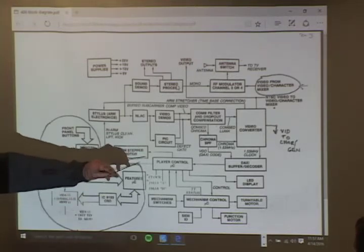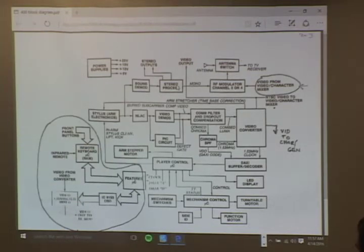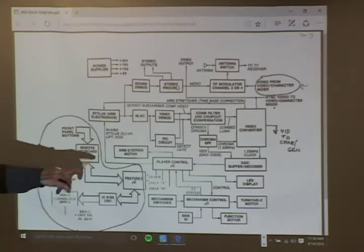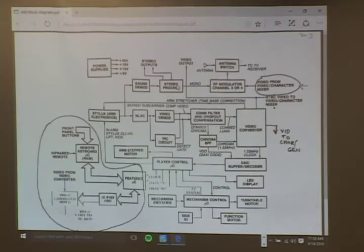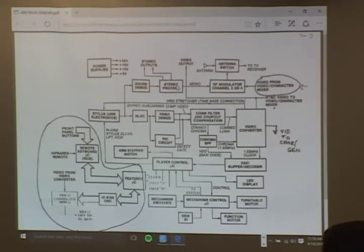Player microprocessor control units are extremely reliable. People have ordered them for me, but I know they may not fix the problem. The problem is the input to the microcontroller. A mechanical switch might be wrong, something is open. So, unless you're absolutely sure that one of the microprocessors is bad, I wouldn't even change these. Any questions?